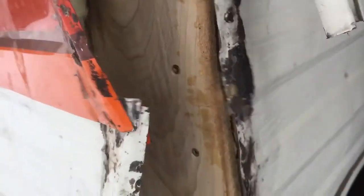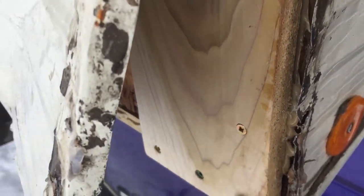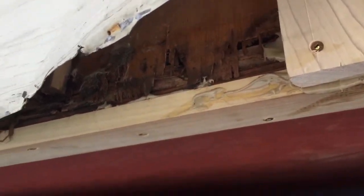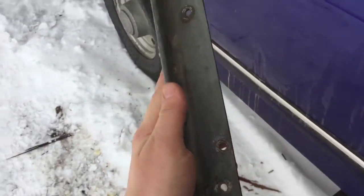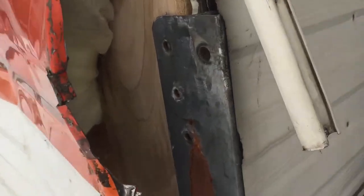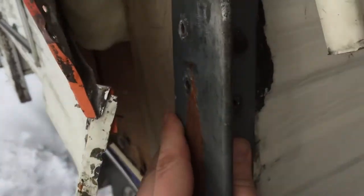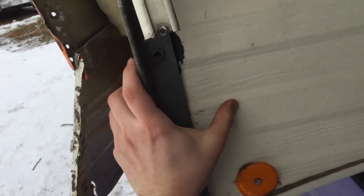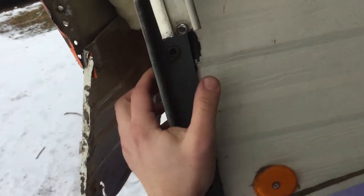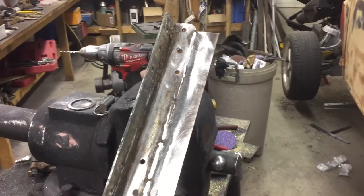I got this replacement piece glued in behind there in both places, and put in a bunch of three-inch screws all the way back into the frame and all the way down. I still have to cut up this bottom piece, but I have to get that from my neighbor who's busy right now. For now I'm going to take this old bracket — it used to go on like this, and on one side the holes have good meat to bite into. But on the other side the holes are pretty haggard — they've been drilled out several times and are pretty loose.